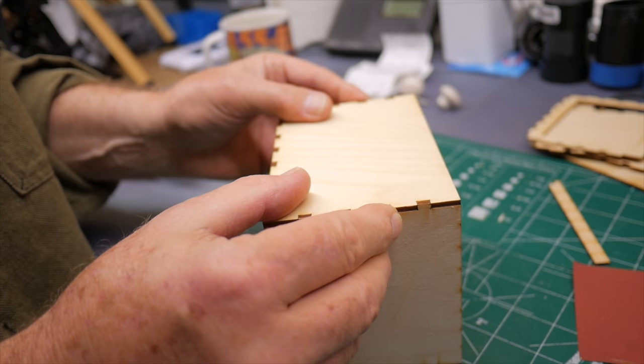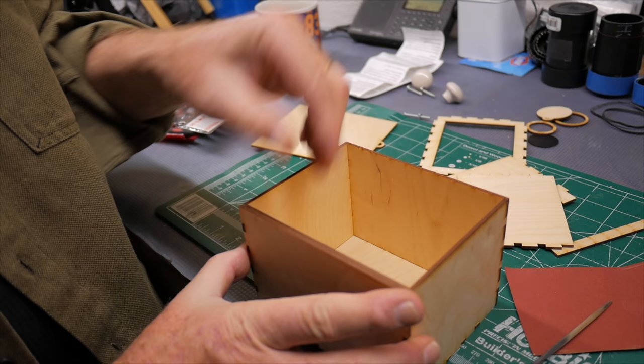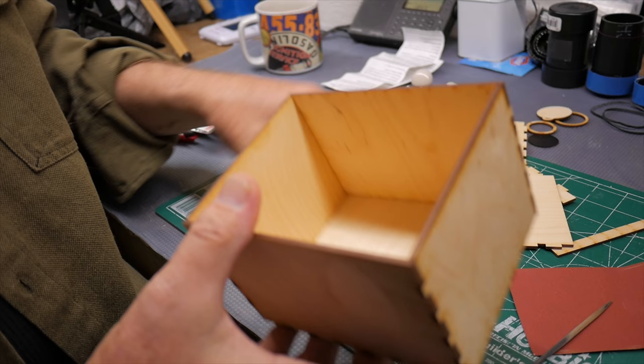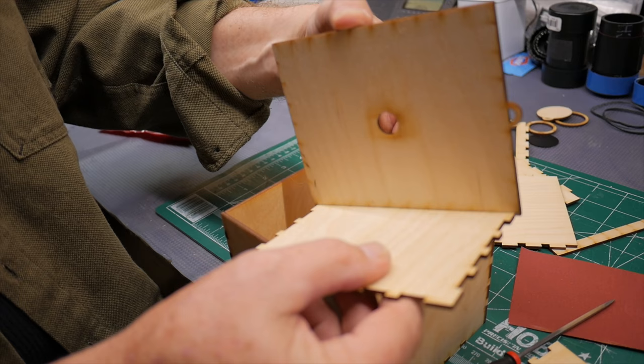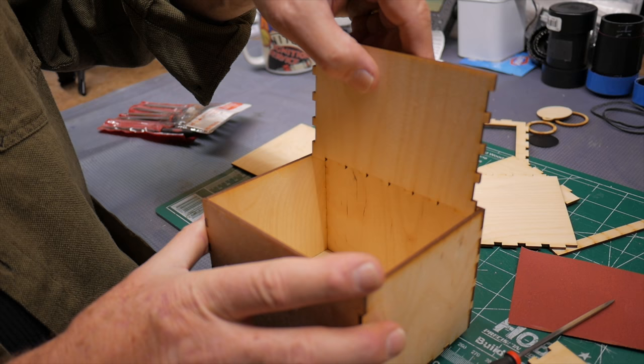With that done, I'm lining up all the notches and pressing them together. The back half needs a little more fitting. I've pressed all the joints together on the outer box and they look nice and flush. I haven't put any glue on yet — just test fitting. The two long pieces of the inner box: the smooth edge goes toward the front of the camera, and that front half does not have interlocking joints — it just glues on.